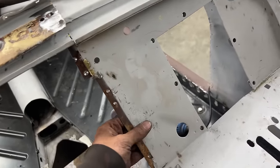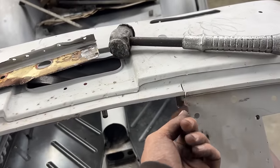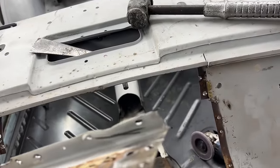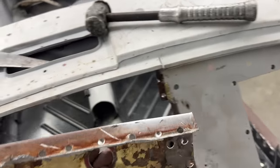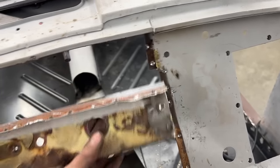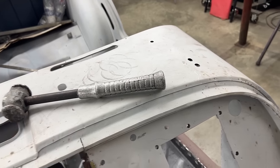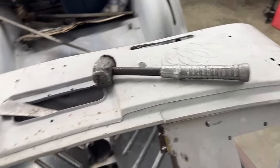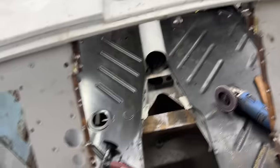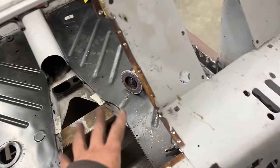Okay, we bent it a little bit here — it was catching — but we're going to straighten it now. Unfortunately, I had to make a cut through the gutter because this was apparently welded here — welded to this part. I'm assuming they assembled the bulkhead with the battery box there, welded this part to that part, and only after that the gutter and that other section came after. Anyway, what I'm going to do now is take a grinder, grind all that, weld wherever we need to repair, and grind again. Straighten it and I'll bring you back.